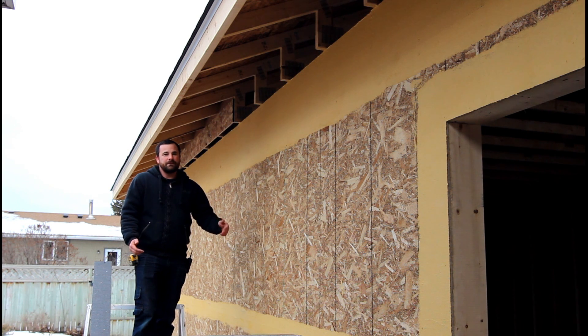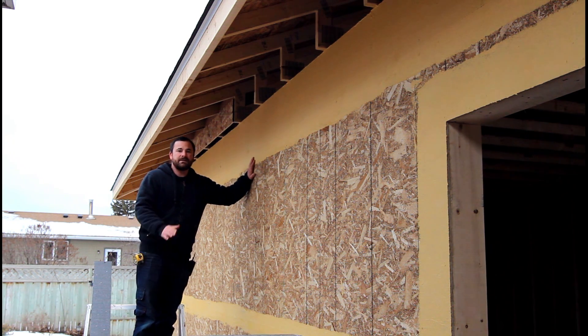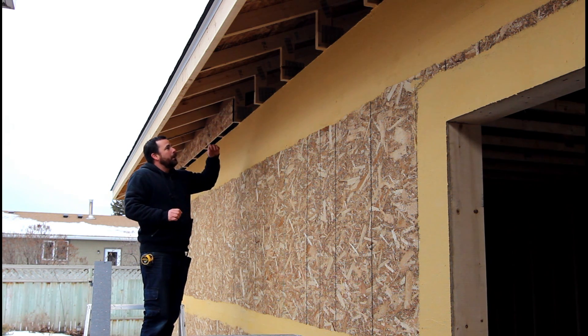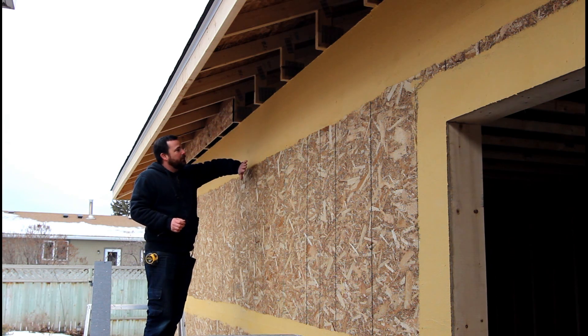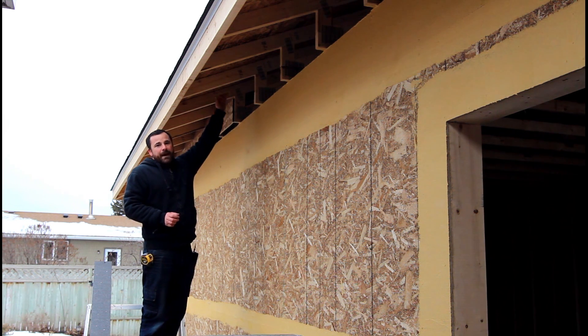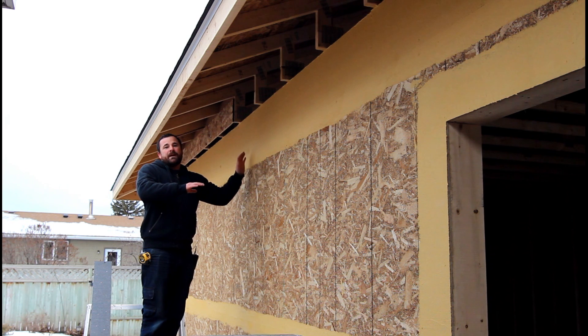Today I'm going to show you how I'm adding R10 to my garage with a stucco system called EIFS — Exterior Insulated and Finishing System. I want to show you, thinking about projects as a whole: I'm doing this on my garage because I need to rebuild it right now, then I'm going to use the same system on my house. We're shooting this video at this stage because I want to show you how I'm tying this insulated exterior system in with my attic insulation to stop thermal bridging — and this is what I'm going to do on my house as well.